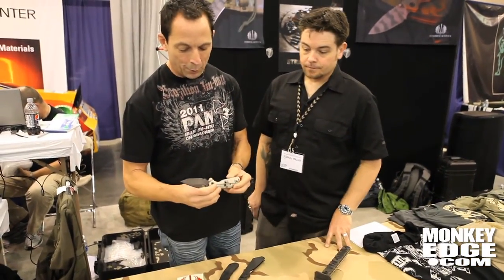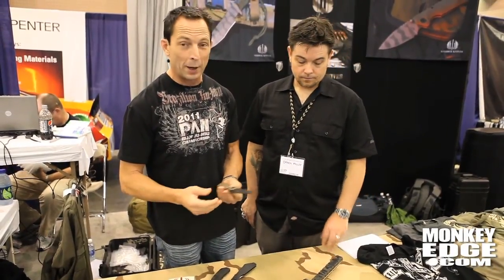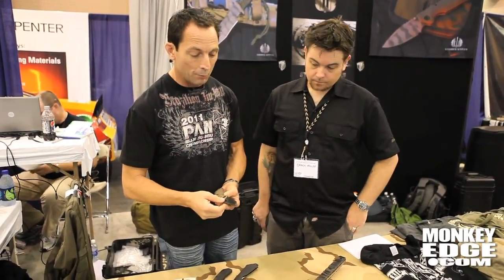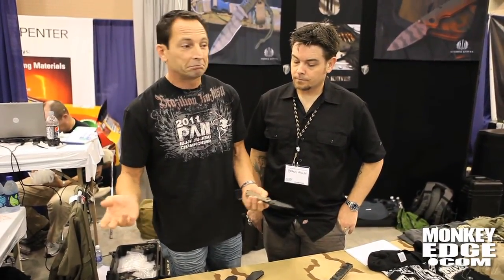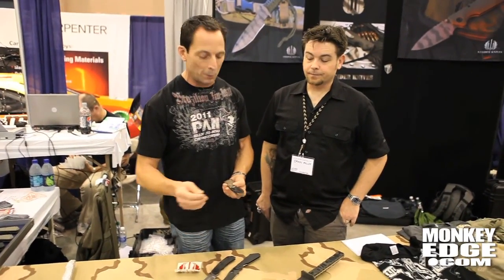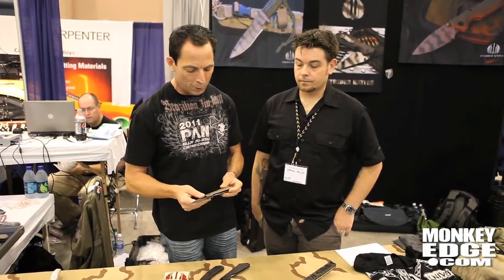Everyone is under the impression when you deal with aluminum that it's an expense issue, that aluminum's just cheap to work with. Aluminum is a fairly inexpensive material to purchase and readily available, more so in both of those aspects than G10 or carbon fiber. Machine time's the same. So the money is really in the man hours that you've got involved, not so much in the material. It is a lot nicer to machine because it doesn't muck up your machines. Glass epoxy substrates are real hard on machinery.